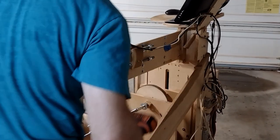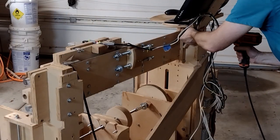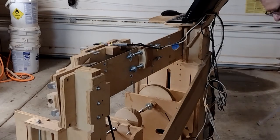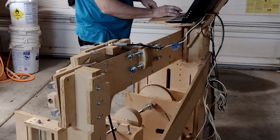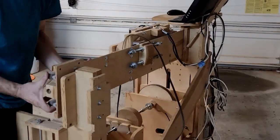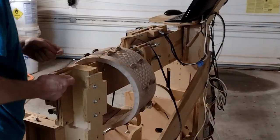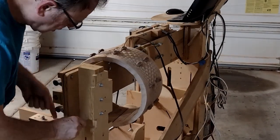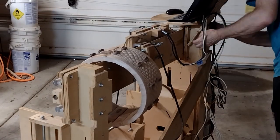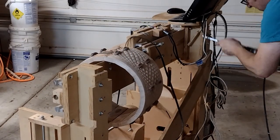Now I'm going to loosen the gantry so I can lift it out a little bit and put the drum around the gantry — kind of a weird process, hard to explain, but when you watch it it makes a lot more sense. There are eight bolts holding the gantry in place — I'll take seven out and loosen the eighth one, the last one, the pivot point. Now I can lift it up and put the drum on. Now the drum is around the gantry, it's time to put it back together. I'll finger-tighten the bolts back, then get my drill with the socket on the end and tighten everything back up — actually a pretty easy process.